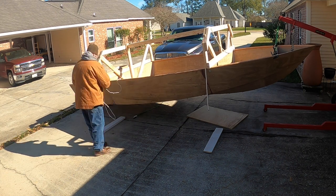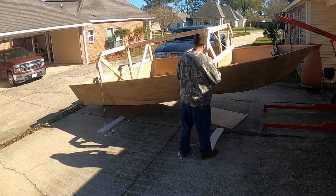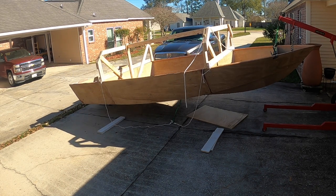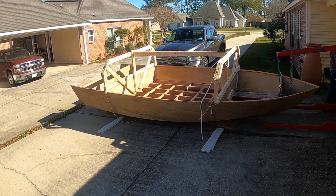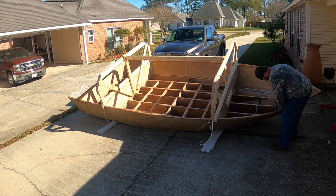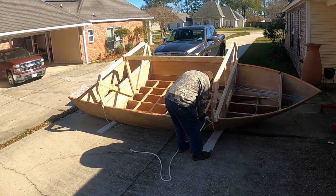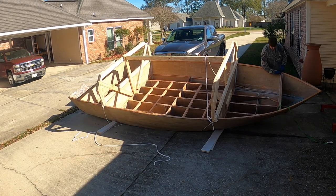Here I'm just holding the front with that engine hoist and on the stern I just had a little automotive jack. These ropes I'm putting together will actually go up underneath the hull and back to the front of my truck, so whenever I start rolling it over the hull won't slide away from the truck as a reference. Now that I have those ropes in there and those boards underneath my rolling cradle, they'll just keep all the pressure on the little stands I have there so it won't be laying on the hull side.